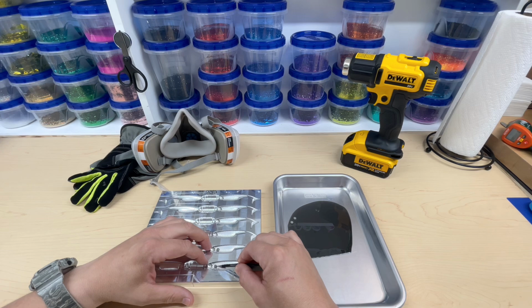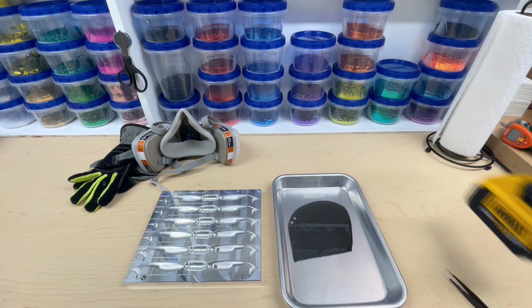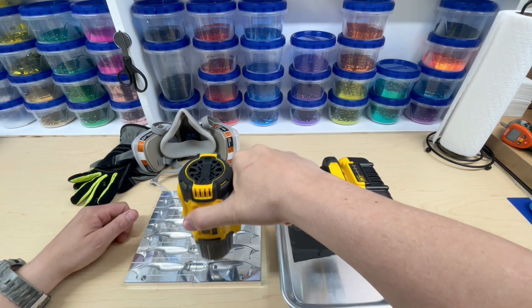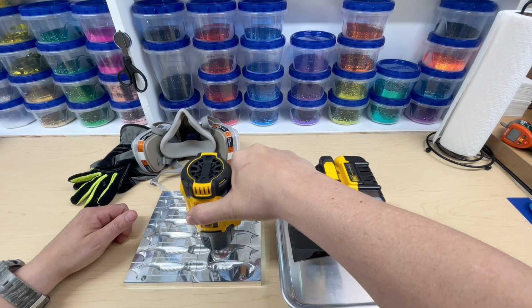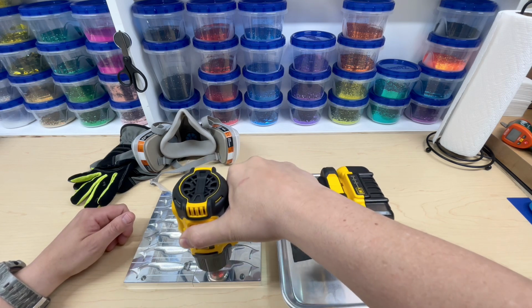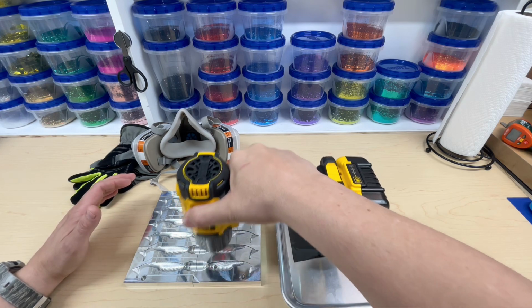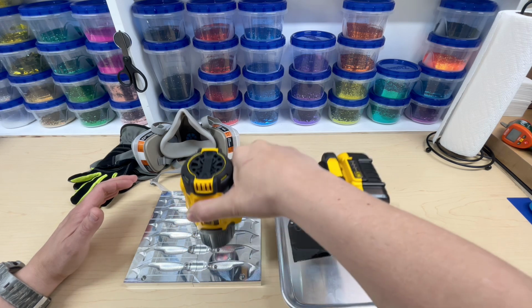Grab that one. So I'm putting it right behind the gill plate, and so they stay, I'm gonna take my trusty heat gun here, and I'm just gonna heat them up so they stick to the mold. I've pressed down pretty good onto them, but this will actually adhere them to it, so when the injection is going through, it won't take them off.